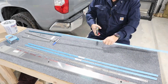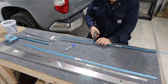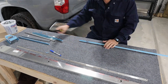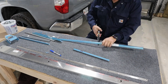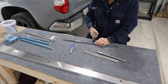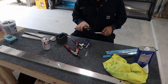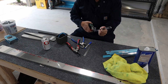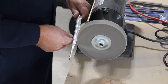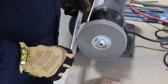What I'll find out not too long after this is that it's much easier to do this work on the bandsaw. You end up doing a lot of these stiffeners — not just for the rudder but also for the elevators. The instructions tell you that the wood cutting blade that comes on a bandsaw is good enough for soft metal like thin aluminum, but if you spend about 10 bucks to get a metal cutting blade, it makes everything 10 times easier and almost 10 times faster. That's what I ended up doing later on with the elevators, and there will be a video on that coming up.